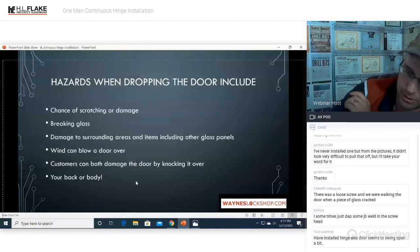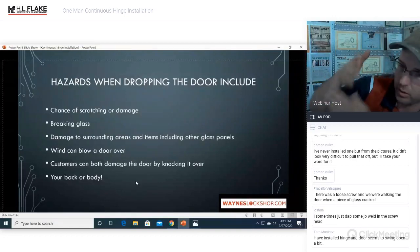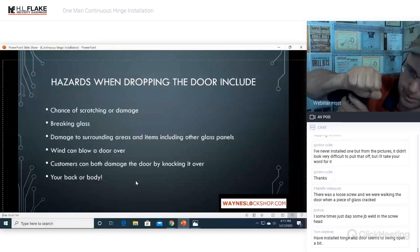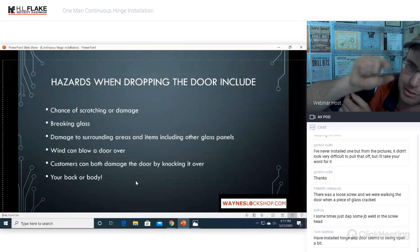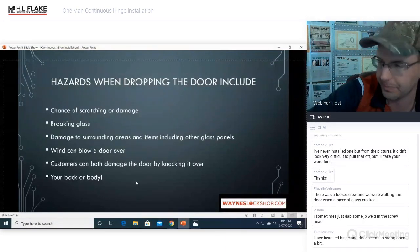If you haven't seen a nutsert or a blind nut or don't know what it is, look it up on Google after we get done. They are cool. They actually go into that hole. You crimp it in place and it gives you like 5 or 6 threads. It's basically like putting a nut behind the door blind.